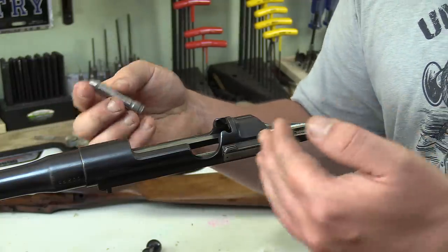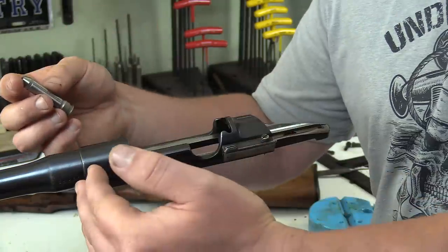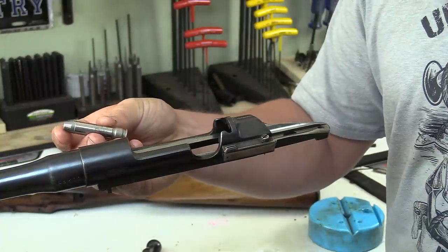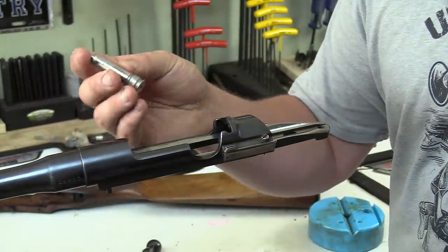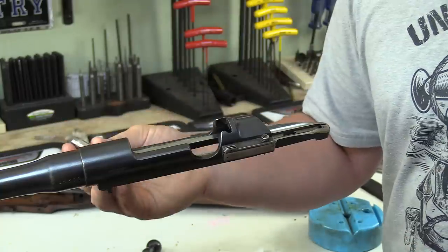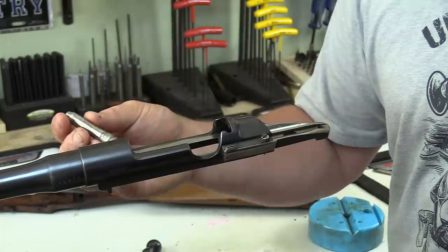And because you're not working that brass, like resizing that shoulder all the way back down, then fireforming it back out, sizing it down, firing it out, you're not repeating that process, so the brass will last a lot longer, and you're essentially creating custom brass for your rifle. So it doesn't mean this gun is dead in the water. It just means that it's going to work the brass a heck of a lot.